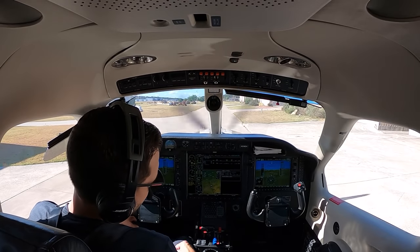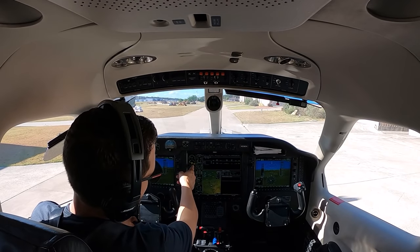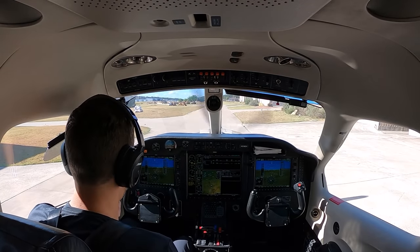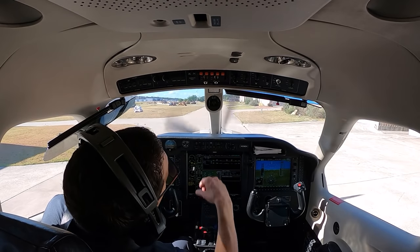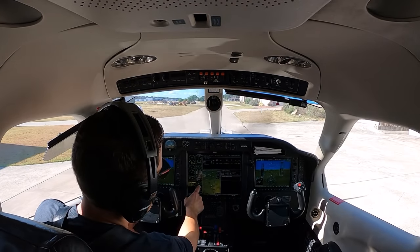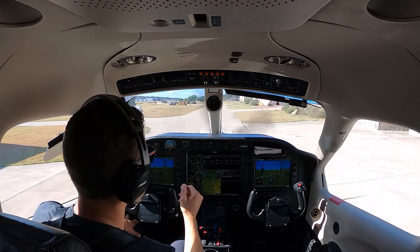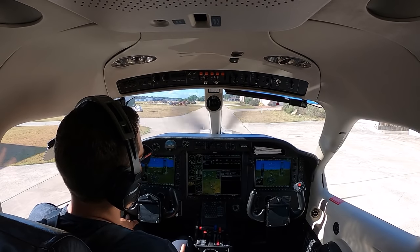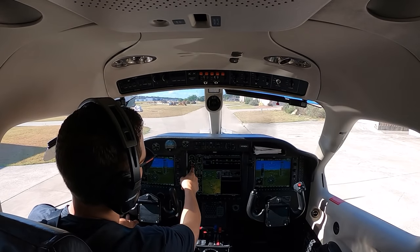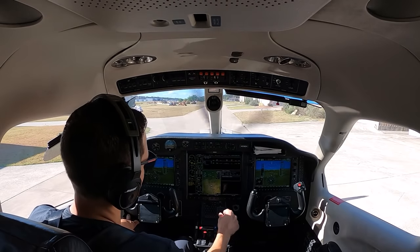Before we even start rolling, I like to do my hop feather. We bring the prop lever all the way back to feather position, wait a couple seconds — hovers around 500. That's good, go back up to full prop. While we're waiting, we're going to do the generator test: go to the standby position, press standby — we should see the backup generator picking up the load. That looks good, going back. You have to make sure your battery amps are under 50, because your second generator is limited at 50. Main generator picked back up. Prop is back around 1100 — we're going to feather it one more time. Looking for it to get to about 700, going back in feather, put that back.